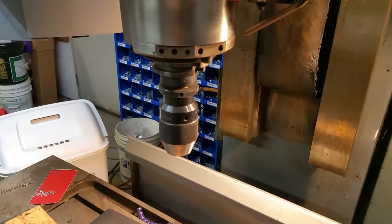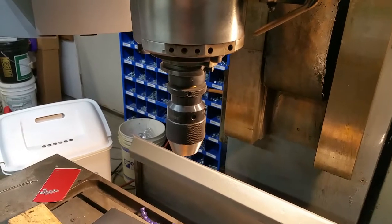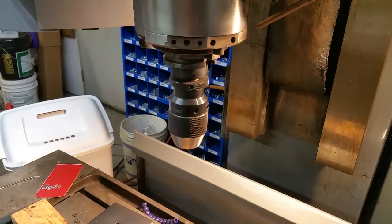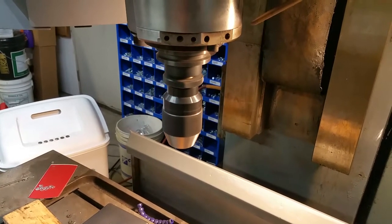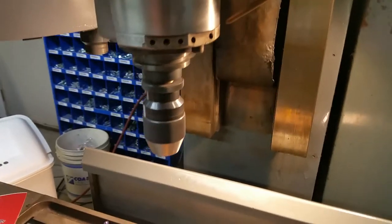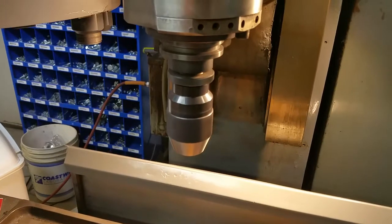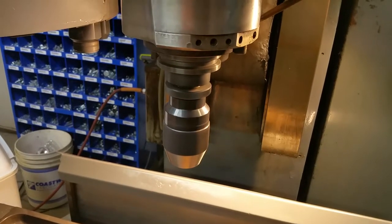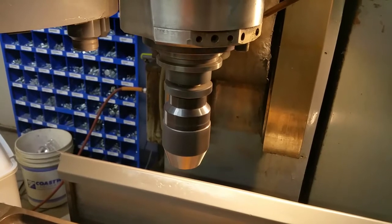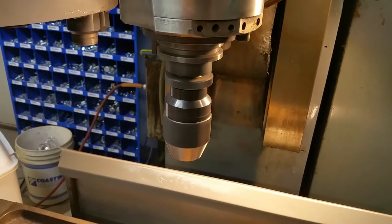The acceleration ramp is how long it takes to get to max speed — in this case, 5 seconds. But in this setup right now, it should take basically less than a second. The factory settings are about 2.2 seconds to 5000, which is in the middle range — 2.2 seconds to max speed on the voltage scale, which in this case is 171 hertz or about 5000 RPM.